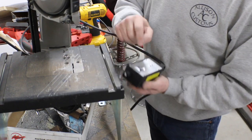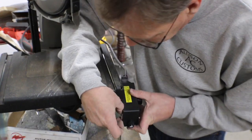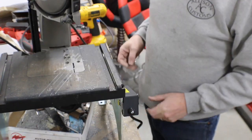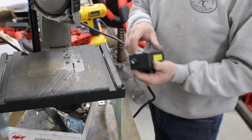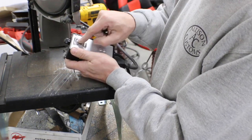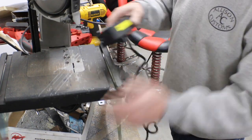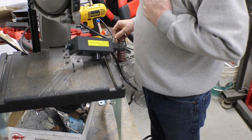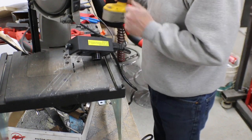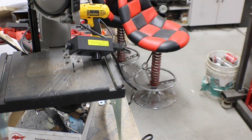So my thinking is I'm gonna take this clip off. I mean, you could probably just do something like that and it would hang there, but no. So I'm gonna drill these two rivets out, put a nutsert in there, drill a corresponding hole in here, and then bolt through from the inside out. So let's do that step. We need a small, probably a 1/8 inch drill bit for those two rivets.